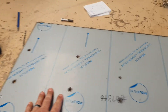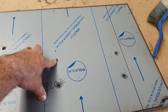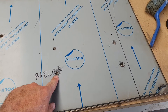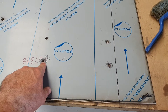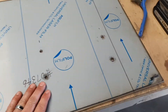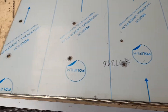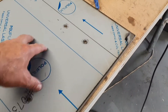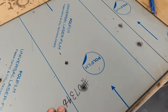That's the compressor holes; these ones are the motor. You'll see me drill this one again by hand because it's too far to fit on my drill press. What we've got to do with these ones now is connect these two together with big slots which we'll cut with the angle grinder, so that the motor is then adjustable to tension the belt. We'll have to sort out a size when we're ready. I'll mark this up for some nice slots, get the grinder out, cut them out — hopefully I measured everything right.